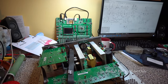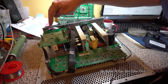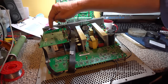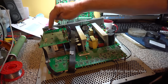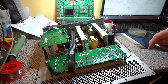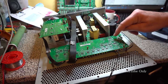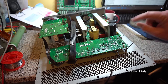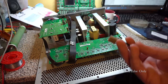And what happened when I actually got the amp running correctly? So two new chips, four FETs. Yeah, so two new chips, two FETs that I had to replace twice because the chip blew them up again. So two new chips, two FETs, the fans came on. So now we've got fans and we've got a power light. So now presumably our limit line won't be pulled down to minus 15. It'll be up above that 7.5 threshold, because we've got our power light. So I'll just have to put it back together and see if we can get some sound out of it.